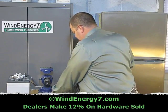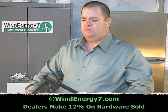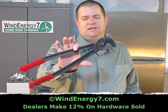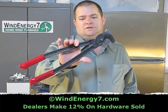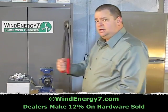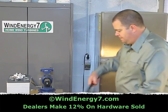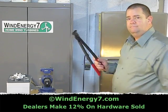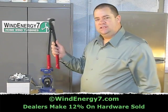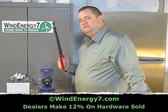One of the tools I use — not just for battery cables but in general for wiring — if you're going to cut something as big as a battery cable, you need a big cutter like this. They make one smaller that's about 12 inches long. You can get this at any hardware or electrical supply store — Lowe's or Home Depot. That's about a $65 or $70 tool. Let me show you what it can do. You can imagine how hard it'd be to cut a cable that thick — that's a 2 gauge cable. Put that around it — boom. There's a shorter one that's a little cheaper you can get that'd be fine. It looks exactly the same. It's a must-have tool if you're going to be a pro.